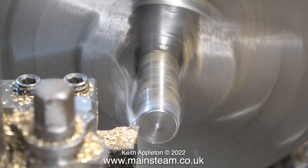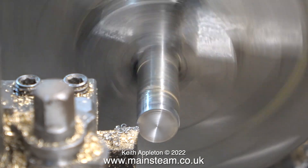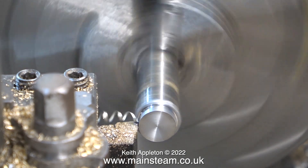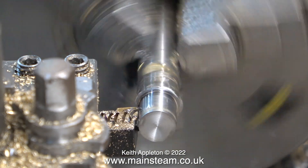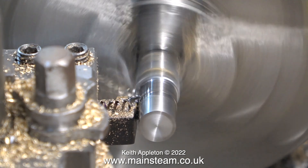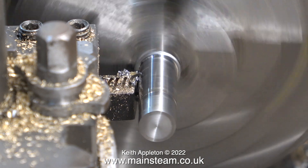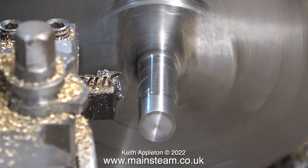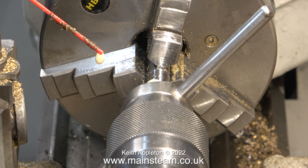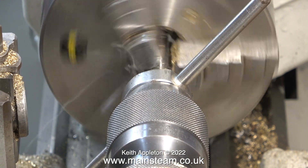I'm trying to do everything wrong in this episode. As I pull the piece of bar out of the three-jaw chuck it's not running truly — not a massive issue because I'm going to turn it to the correct diameter. The bar may be bent; it's just a piece of scrap. For this part of the experiment I'm purposely turning the first part of the bar under size. For a successful accurate thread the bar needs to be turned to exactly 7/16ths of an inch, as I'm using a 7/16ths by 26 TPI die. So now I have a bar turned down to 7/16ths apart from the end, which is 2 or 3 thou undersize. Before I start threading I'm spraying the bar with metal cutting lubricant. I've engaged back gear to slow it down, but it's not really running slow enough for this job.